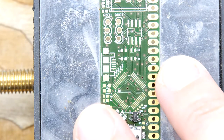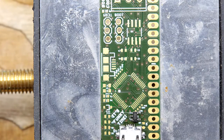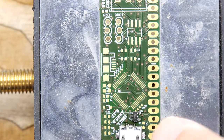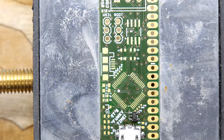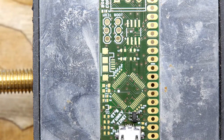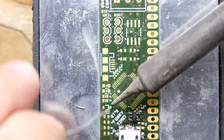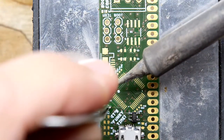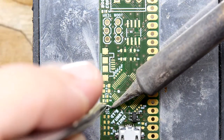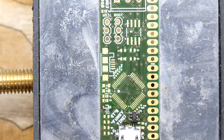I think that's pretty good - it's real good. So just one more thing to do, which is where that diode is supposed to be. I'm pretty sure I just don't have one of those so I'm going to just jumper that. That diode is to prevent - if you powered up a booby cortex from an external power source on one of these pins - to stop any juice getting into the USB basically. I'll have to make sure when I get these boards made for production that that part of the bill of materials is definitely there. If one of you folks at home buys that, you have the opportunity to blow out your USB port if you hook it up to 12 volts - your computer's not going to enjoy that. So that's our solder jumper right there, a bit of wire.